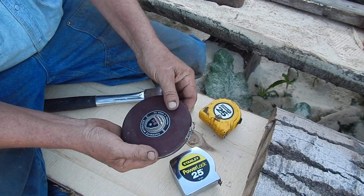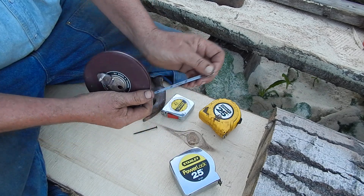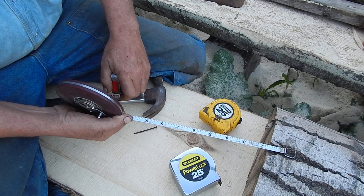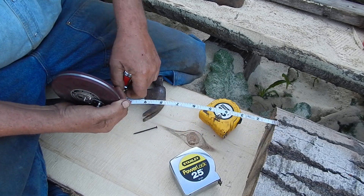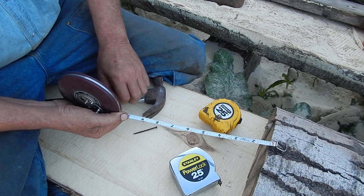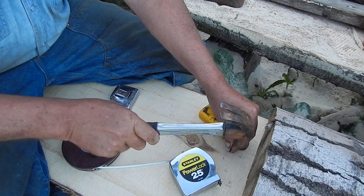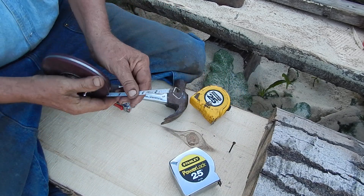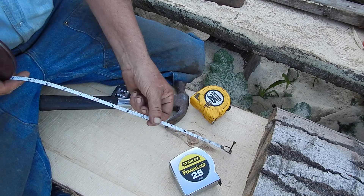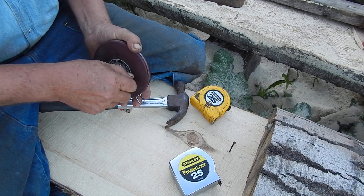This is a really different tape in the first place. It's a hundred-foot tape, but it isn't actually in inches — it's in feet and tenths of a foot. That distance there is more than an inch between markings. From the end to the five is about six inches, and that's where these are used with a nail. So you drive a nail in, or a spike of some kind, and then it tells you feet and tenths of a foot. I'm sure that drives some people crazy, but that's the way they were doing it. It's easy enough once you know that's what it does.